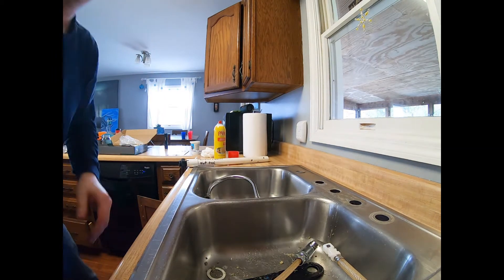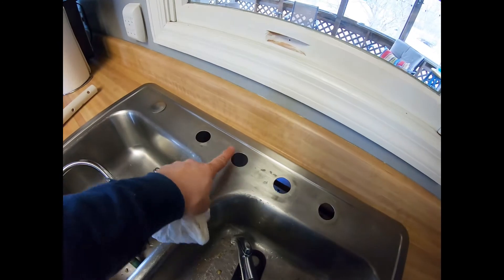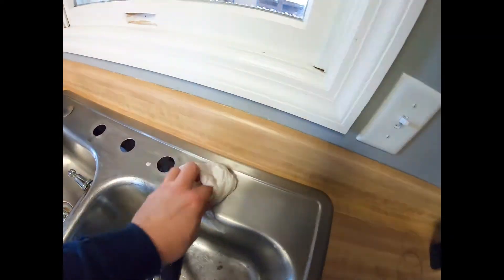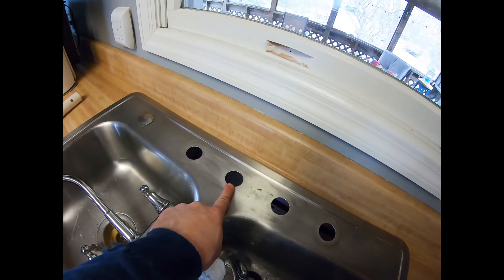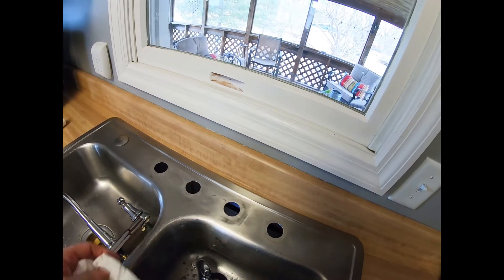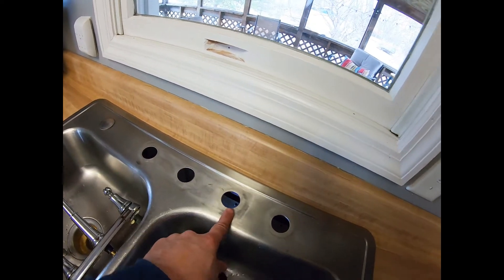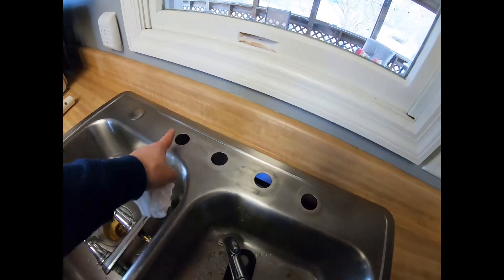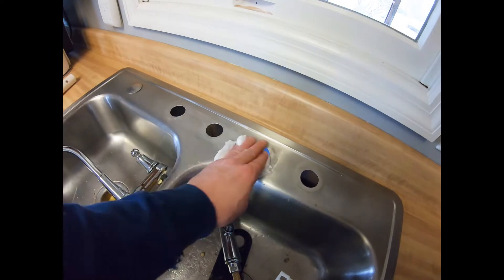That's the old one. Now here's what we're dealing with — this is what they call a four-hole sink: one, two, three, four holes. A lot of times you'll have a three-hole or a two-hole. This fourth hole is for the sprayer unit. Sometimes you can have just one hole for just the center. You need to know how many holes you have when you go to buy your faucet. You don't have to use them all, but you do have to cover them all. If you have holes and buy a one-hole faucet, you need a plate to cover those holes. By the time you buy all the cover plates, you're better off just buying a four-hole unit.